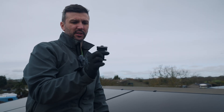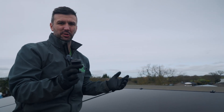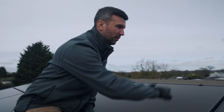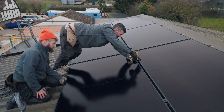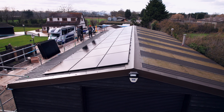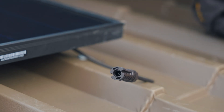A little tip: if you've got any spare mid or end clamps, make sure you leave spacing between the panels for thermal expansion. We've seen lots of installers butt the panels right up together, but you want a 20mm gap all the way around every panel. The edges are metal, and metal expands and contracts with heat, so that 20mm gap allows for thermal expansion.